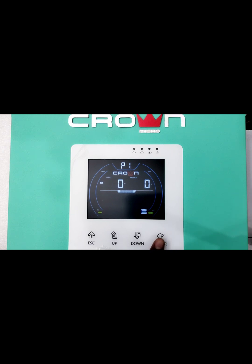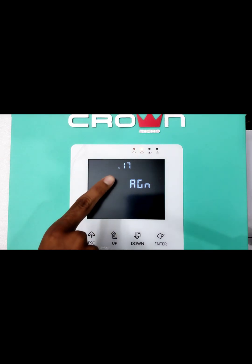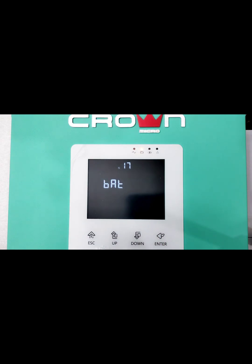Long press the enter key. Go to battery type setting page, option number 17. Select enter key. Select LIB for lithium-ion communication. Select enter. Turn on the BMS option from option 38.